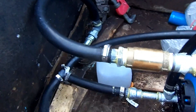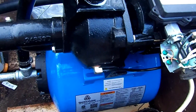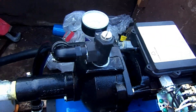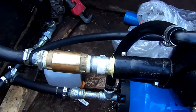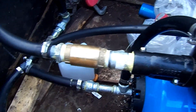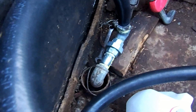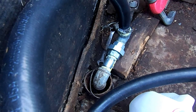Day number three. As of last night it was getting dark and the pump's still not running correctly, even though everything's new. The pump kicks on and kicks off — the overload kicks off — which the manual says means either the voltage is too low or it's wired incorrectly, which isn't really the issue here. The only thing I haven't checked yet is to actually pull the pipe out of the casing and see if the foot valve or strainer is completely corroded.